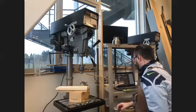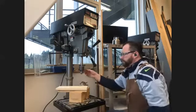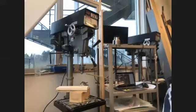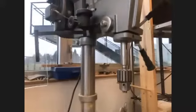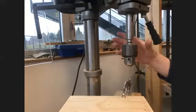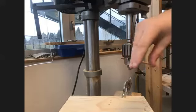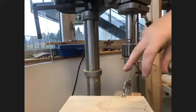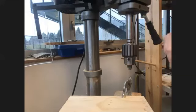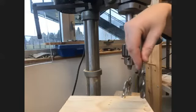To install the drill bit: you have a three-jaw chuck. Some of you have what's called a keyless chuck. These three jaws come down and grab evenly. Whenever you clamp on the shank of a drill bit, you want to clamp on the smooth portion — you do not want the jaws of the chuck to clamp on the flutes. You'll ruin the drill bit if you do that.